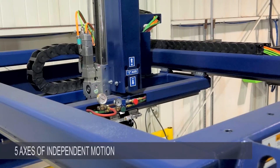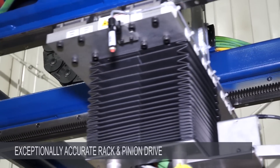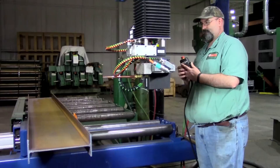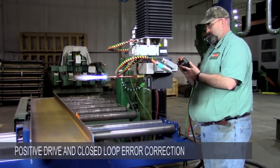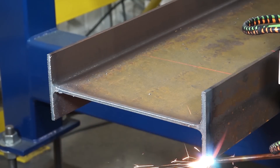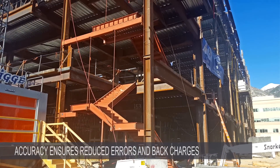The Liberator has five axes of independent motion. Positioning in both the X and Y axes are accomplished by an exceptionally accurate overhead rack and pinion drive and measuring system. Torch height is also controlled by a third rack and pinion measuring system. The W and V rotation axes are controlled by direct gear drives. The closed loop system ensures continuous error correction and accurate positioning every time. Accuracy in all directions is within 1/32nd of an inch, ensuring fast and reliable on-site erection of your fabricated structures.